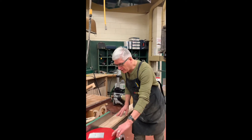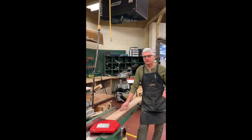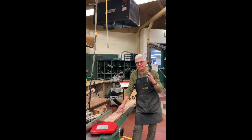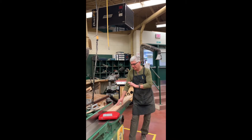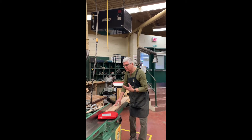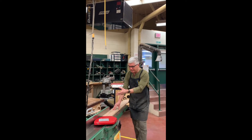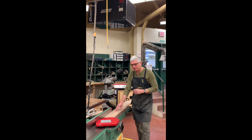It's very important that the guard is a working guard and in place. If something's wrong with the guard, you would tell your instructor. The first thing you're going to do is ask permission to use the machine — this is a junior high presentation, so you want an adult to know you are using the machine and that they have approved your ability to use it. You've gone through testing so that you know how to use it properly. Wearing goggles is important — the small particles of wood that come out here come out very quickly and could do serious damage to your eye.